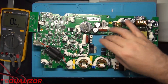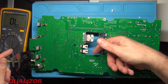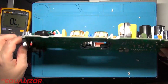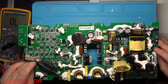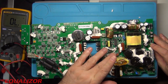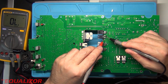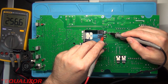They're getting pretty hot. That might indicate a problem with one of those transistors. Possibly that one. Actually, we've got a diode and a transistor there. That looks like it's going to the diode — that is quite toasty. So that would indicate there might be a short circuit. Here's where we ought to be checking. Right, so we've got a short circuit there.